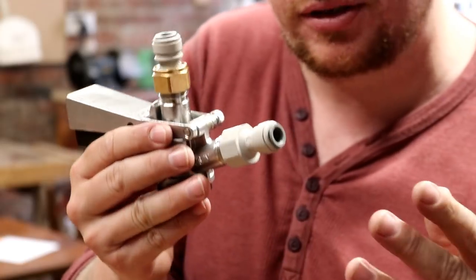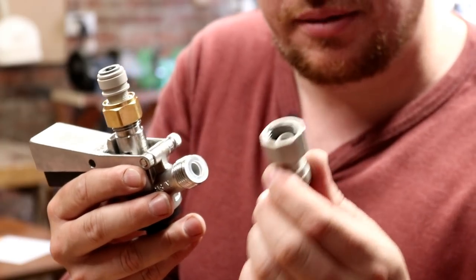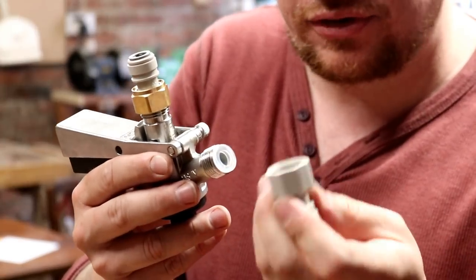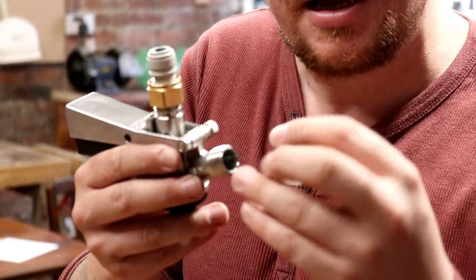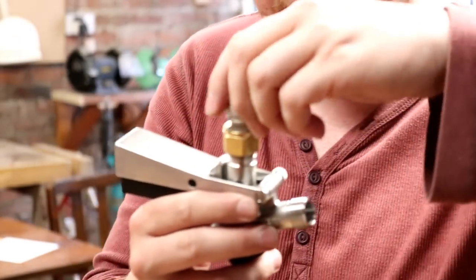So in order for us to modify this, we're going to have to remove a few items. First, we're not going to have gas in anymore. That's going to be actually the drain. That's going to be cleaner out. So we have to remove the gas connector, the 1/2 inch to 3/8 BSP connector, and remove this little non-return duckbill kind of thing here. And the same on the top.